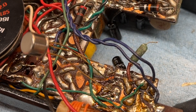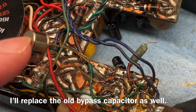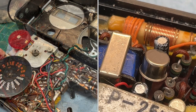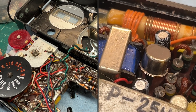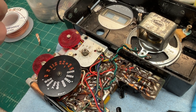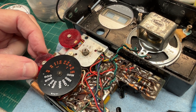I pulled the collector out only and just soldered in the NTE 102. You can hear it's quiet now — kind of the noise you would expect to hear. It sounds more like a normal transistor radio now. Run the volume down and you don't hear all the hissing noise.